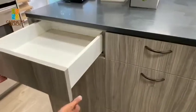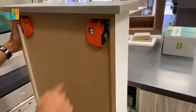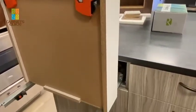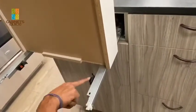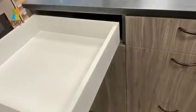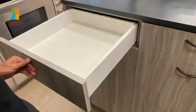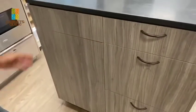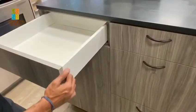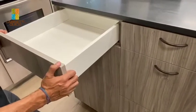So this is a tip-on drawer guide. Works the same way. It's from BLUM. Has the clips, same adjustability. It has a little bit of a different hardware where there's a little mechanism that pushes it open and it clips onto this. This has some adjustability on how to bring in and out the drawer. But essentially, you can push to open and then you have to push to close. There's also doors, same concept. And with this hardware, you're not limited to the drawer. There's metal drawers, there's dovetail drawers, and you know, there's always a dowel drawer.